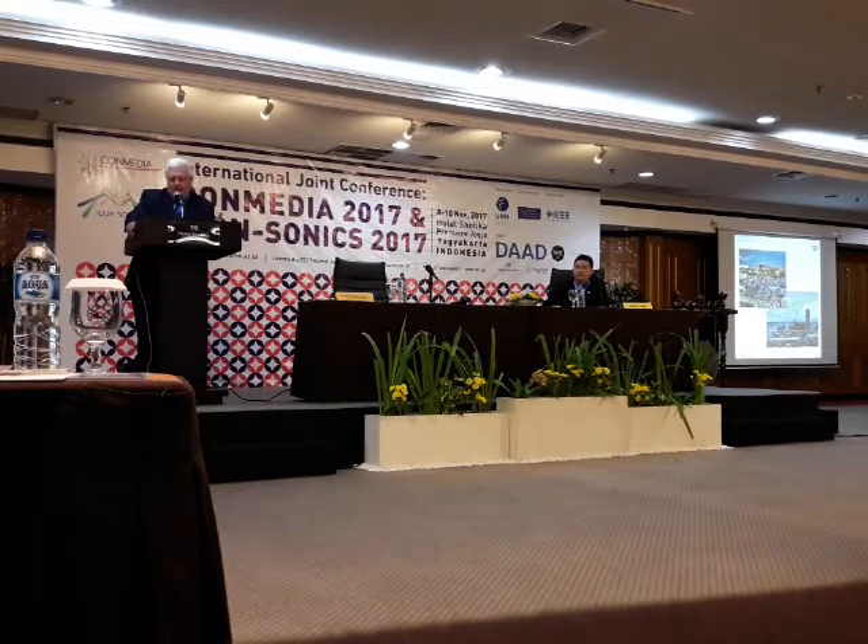Regarding floor energy harvesting: yes, you have a moving up and down motion. This is similar to what they have in dance floor applications or footpath generation applications — they have to move up and down. The stroke you generate can be different depending on the design. But if we have a hinge as you have seen, the stroke can be managed appropriately.